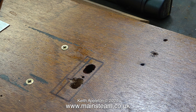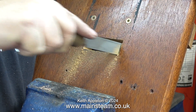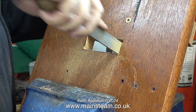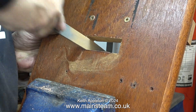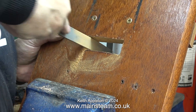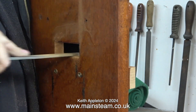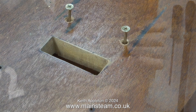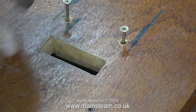I carefully did this in the outer part of the workshop, but I didn't video it because you could only really see me hunched over the piece of wood with a jigsaw. Unfortunately as usual the jigsaw blade wandered about, but it wasn't a problem — using a coarse file I filed the sides of the hole square. This took a while and I actually got quite warm doing this, but in the end I got the rectangular hole nice and square to the baseboard. Filing metal or wood is something you have to practice, and in the end the inside surface of the hole was satisfactory.